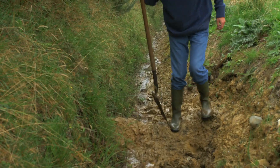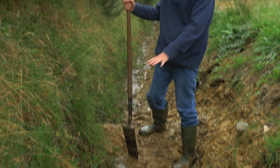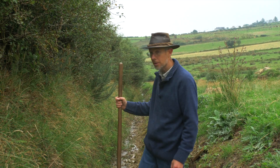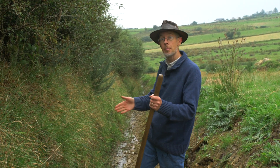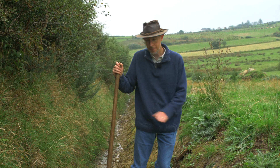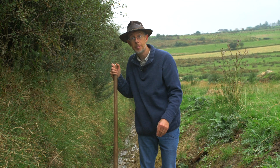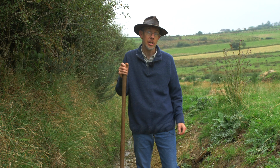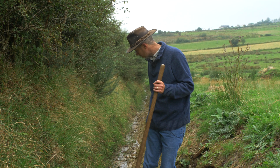This is a dip in the centre before it flows on. In a drain with this gradient, ideally the dams would be maybe five metres apart — quite close together. But if you've got a very level drain you could afford to just have one at the end or maybe one in the middle — it depends on the gradient. Ideally, the water going over the top of this dam would touch the toe of the next dam up, so that you'd have standing water all the way back up along the drain. That's something you can do within the maintenance regime if you've got a digger and you're cleaning it out.